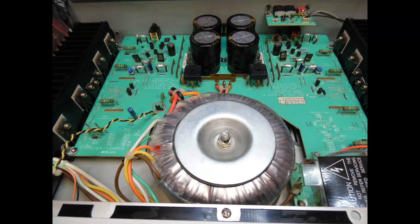In a higher level shot you can see on the right hand side the driver transistors for each stage and the audio output transistors. I've put circles around two of the visible links — there's also a third link — and this is where you would reconfigure the amplifier to run as a monoblock. The reference numbers on the board are S601, S602, and S603. Remember you would not reconfigure the amplifier for monoblock while it is powered — depower the amplifier, set your links, then reapply power. You can also see the board has been thoroughly cleaned as there was dust coating it, which is perfectly normal coming through the ventilation grills.